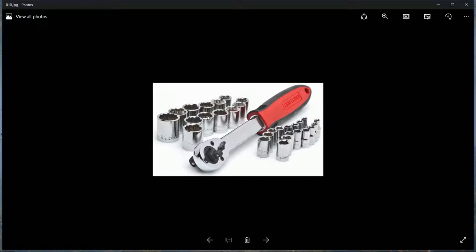Next is a ratchet wrench with sortable heads that you can put on. The ones on the left fit many types of different bolts. I'd go for a mixture of sizes: half an inch, three-eighths of an inch, and a quarter inch drive. So you need three sets of assorted sockets and the wrench for each.